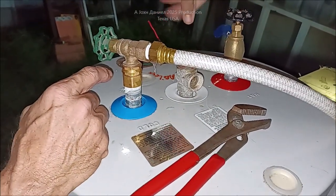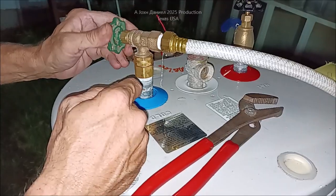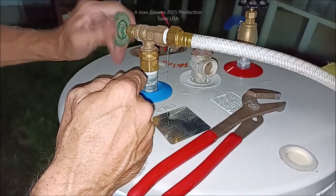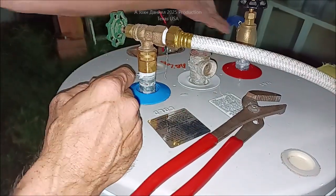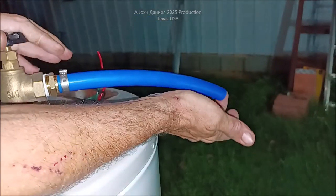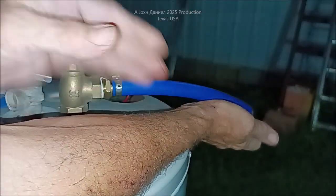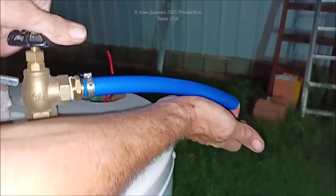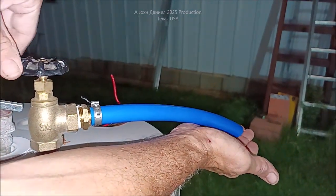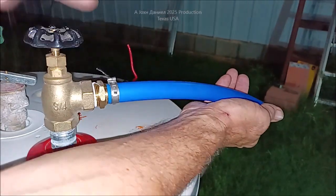Make sure this one here is cracked open because you're going to purge the air out as the water goes in. We've turned the water on full blast. I'm going to turn this off to let the air pressure build up a little bit. That's also where you can check your tank for leaks — letting that air pressure build up from the water going in. You can't compress water, but you can push the air from the water and make compression. Hear the air? It relieved the air. So I'm going to take this and turn it all the way down until it just touches.